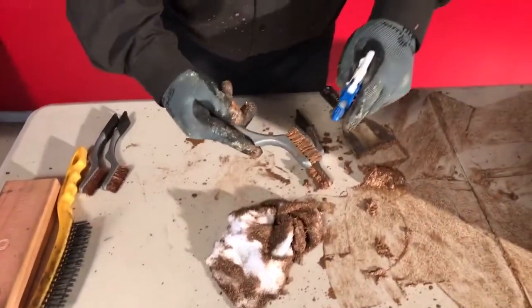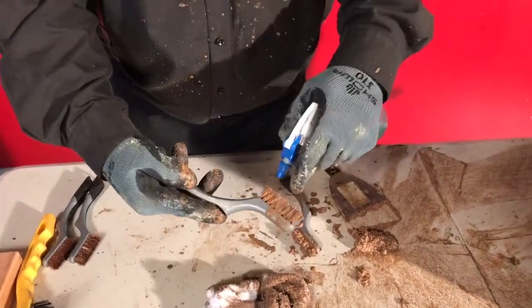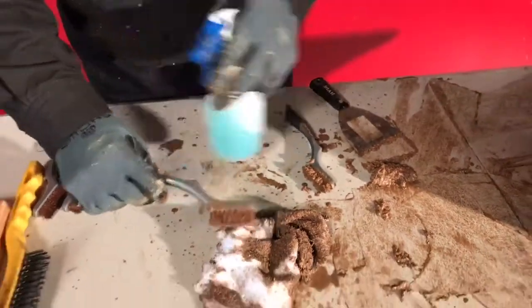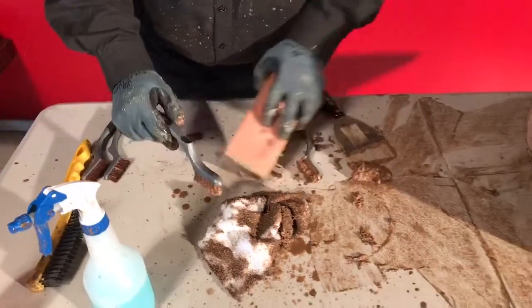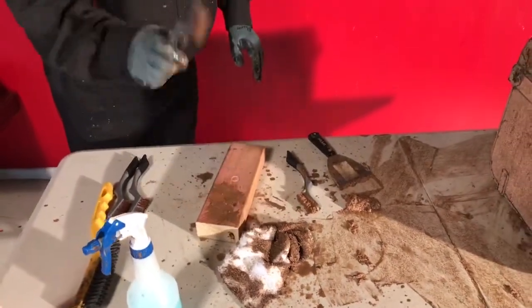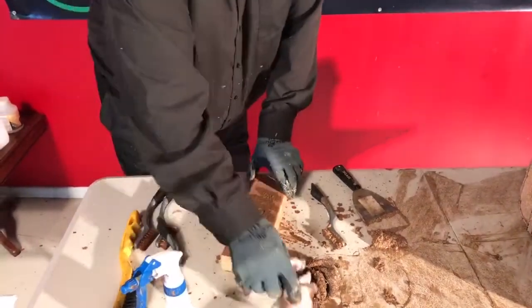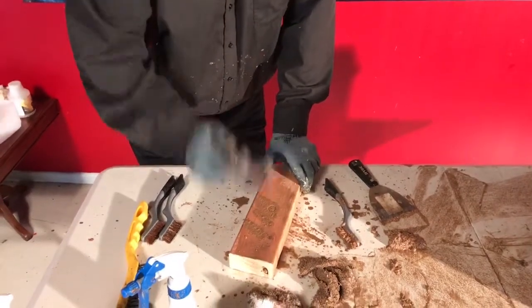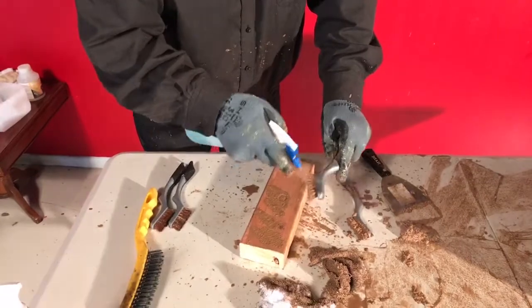that's nice and soft, what I often will do, and you can get yourself another bottle and even put in some meths, which will be cheaper than using your flusher, but give it a quick puff in the bristle, grab yourself a slab of wood, and it all just falls out. So you don't have to wreck your brushes. If you let it all dry in there, then it's a way bigger job to get them clean.